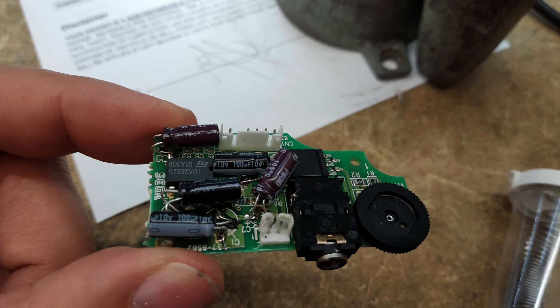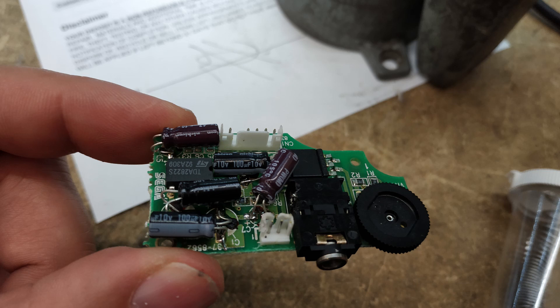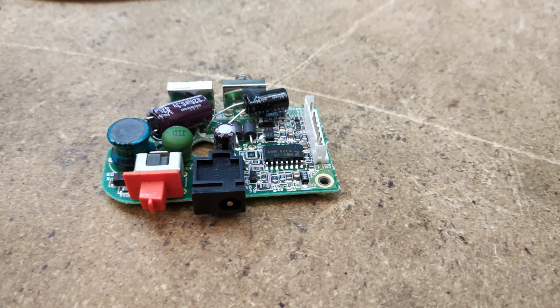This is the audio board — five capacitors on it. One issue with this Game Gear, even before its main problem of turning on and off, was very low audio, which is also common with bad capacitors. It was very quiet even with the volume all the way up. The original capacitors were aluminum surface-mount types, very short and flush. I'm using electrolytics which are much taller, so you have to lay them down flat and find spots around the other components to keep everything flush.